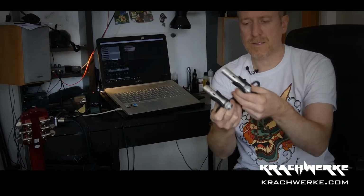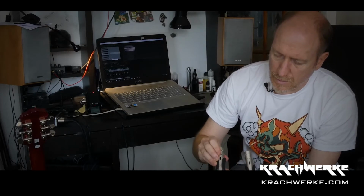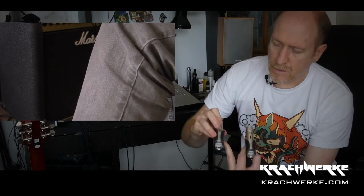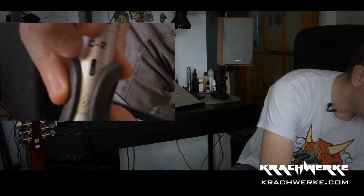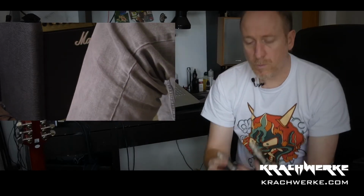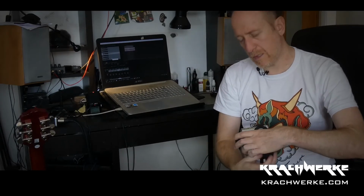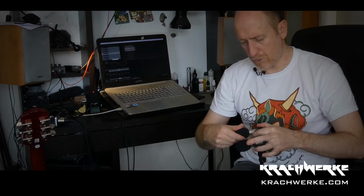This whole thing, except the mic stand, is, I think, something like £40 on Amazon. And they were perfectly fine. And because you've got settings on your pencil, you've got a low cut. I'll show you here. There is a low cut, and then there's a minus 10 dB attenuation. And we will use them. We will go to the minus 10. That means we can put the amp on a little bit louder than we should.